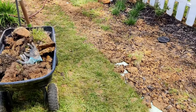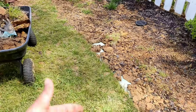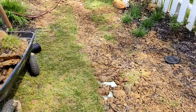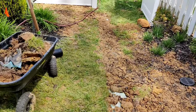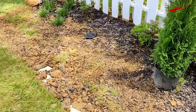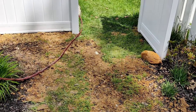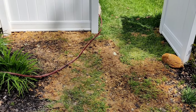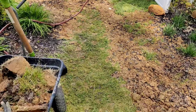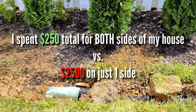Just to give you guys an idea on costs — I know I got a lot of questions about that on my last video. I saved a ton of money doing this myself — this is not a hard project at all. The hardest part is just digging out the trench, and I have North Carolina clay, so if it's wet and muddy it's pretty easy to dig. I did have a couple companies come out and give me quotes, and just to do this one side they quoted me $2,500. The little connector pieces range from about $3 to $14, the perforated sections were $20 a piece, and I just bought one big roll of corrugated pipe which was about $100. So you can do the math — $2,500 versus what I pieced together is definitely a lot of savings.